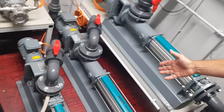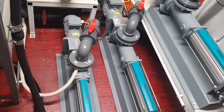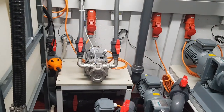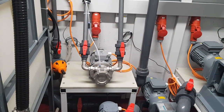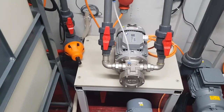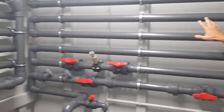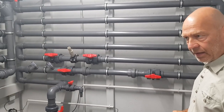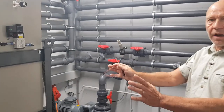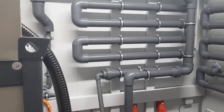This is a pump for example for a denitrification which is downstream installed. On the left side you see the core part — this is a recycling pump for bringing air into the flotation. This is the saturation line here on the top, on the right side you see the mixing line for chemicals, and on the left side this component is a funnel to collect the sludge and discharge it with a pump.